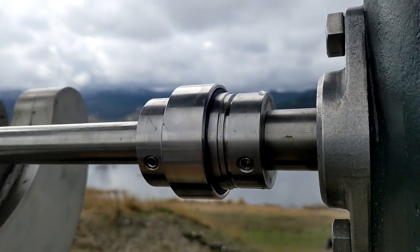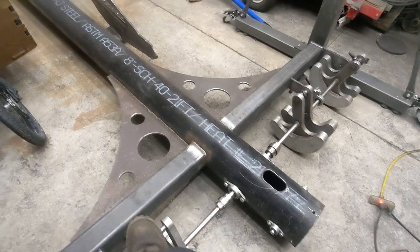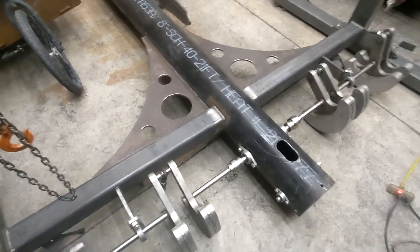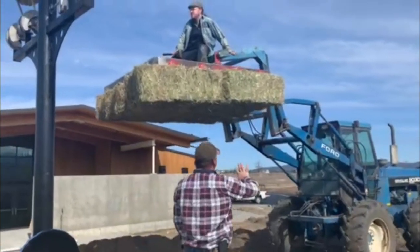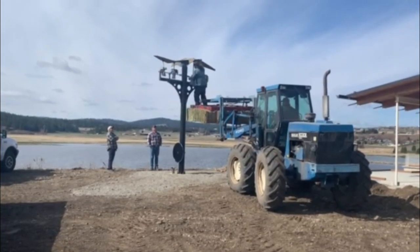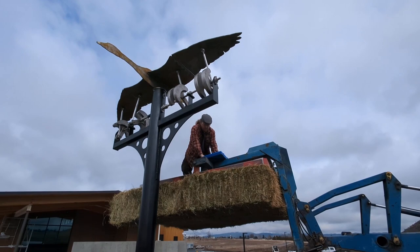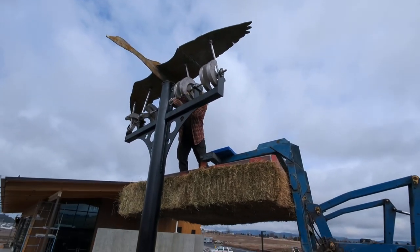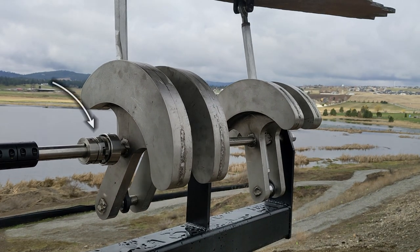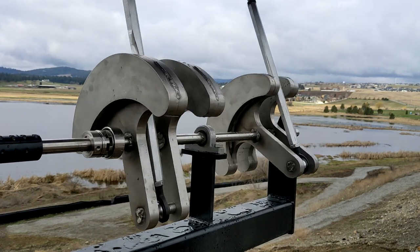The other big problem was the shaft couplers. I had put in high-torque spider couplers since I knew my shaft alignment wasn't going to be perfect, and I liked the extra cushion the rubbery bridge piece added to smooth out shocks. But it wasn't high-torque enough, causing the bridging piece to get shredded and jammed fairly quickly. This was fixable on one side with a higher-torque bridging piece via overnight delivery. But the other side continued to have a problem — that crankshaft had warped a bit too much during welding, and it was just too much for the spider under load. Because everything was designed to not let the crankshaft slide apart, replacing them would have meant removing the wing and crankshaft entirely — not something I wanted to do 12 feet in the air, precariously balanced on a hay bale. But the original spider halves could be slid down the shaft to make room for a two-piece clamp-on rigid shaft coupler. It seems to be holding fine for now, but I might have to revisit this in the future.